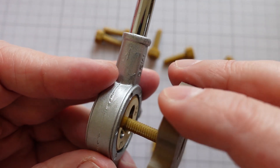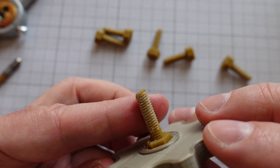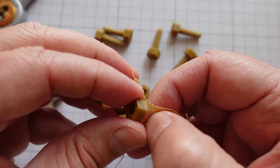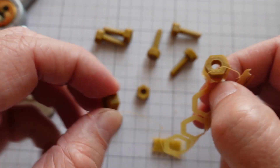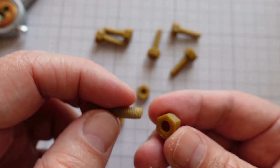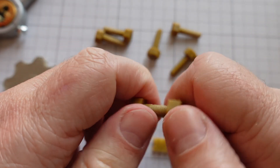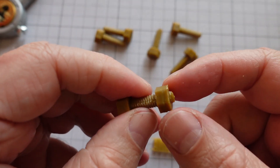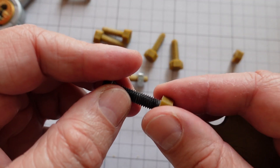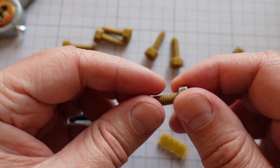This is the M6 die tool. Now the M6 thread is ready. These are the nuts — they are almost the correct size, I only need to remove the brim. They're a little bit tight but almost no cleaning needed. Just in case I'll do a little cleaning with the tap tool. Quick check with the metallic bolt, and also a quick check with the metallic screw nut.